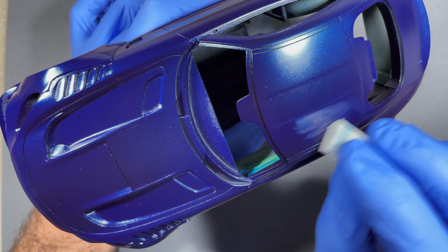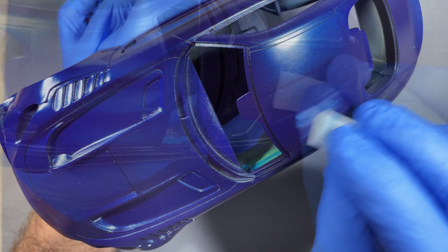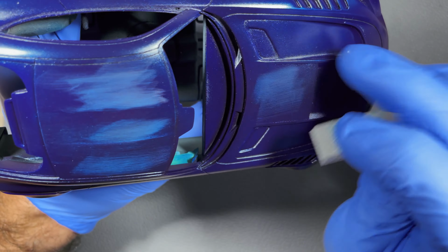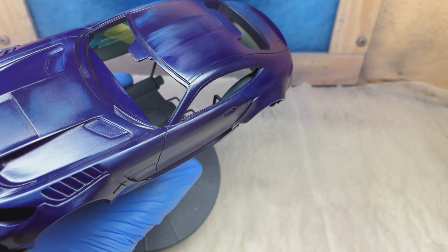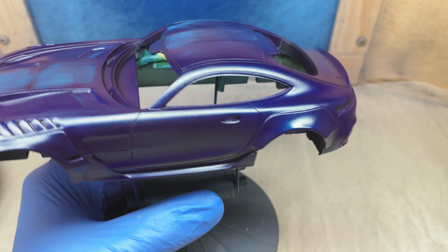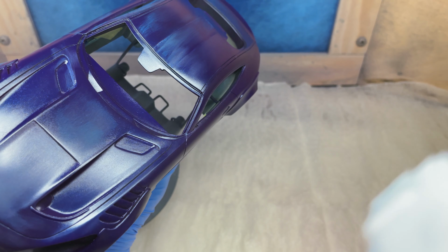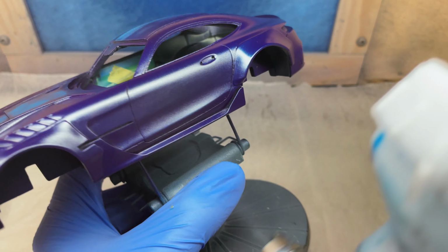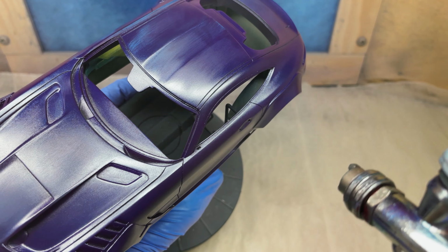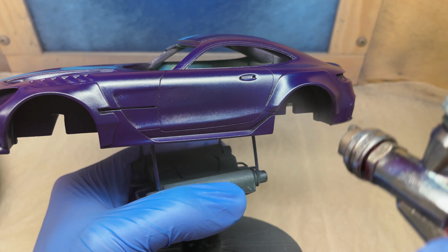After the first layers of blue paint, remove the imperfections and dust before going on with the final layers, to have a smoother surface. You don't need to wait too long, it's curing in less than half an hour. If you're working with thin layers, you can sand this after 50 minutes, depending on your temperature. I'm talking about normal room temperature.